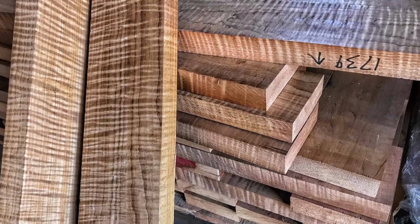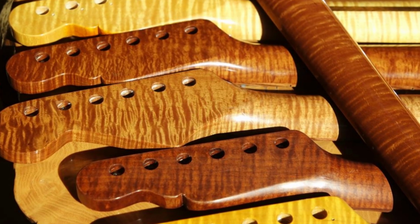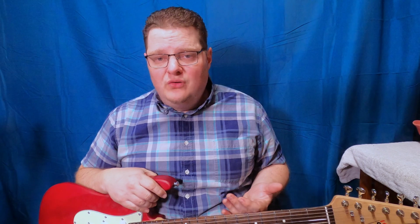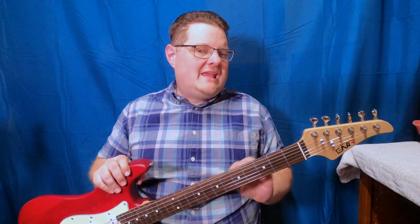Well, why is roasted wood better? Well, let me tell you, heat treating the wood removes excess moisture in the wood and effectively crystallizes the natural sugars that are present in the wood itself, also caramelizing them in the process. The result is a piece of wood that is extremely stable, less prone to seasonal changes, and a little extra beautiful since the roasting process gives the wood a burnt tan color and the color goes all the way through.